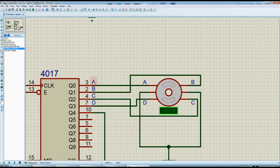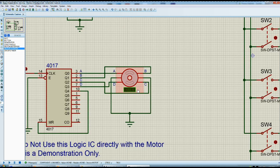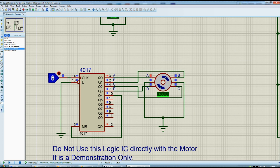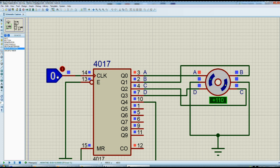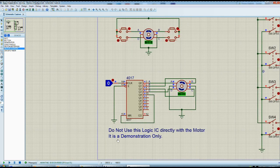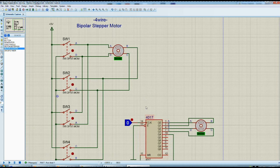As you can see, the markings are A, B, C, D — actually in order this time. But on the other motor, it's A, B, D, C, which is a special case. Now let me explain what the five-wire motor circuit is doing. When I apply positive, each button is linked to positive, and the middle common wire of the five-wire motor — represented in Proteus as six wires — has these two center pins linked together representing the common wire. You can put the common wire either on ground or on positive, but it will change the logic. The current logic is: apply positive through a coil and it exits through the common wire to ground.